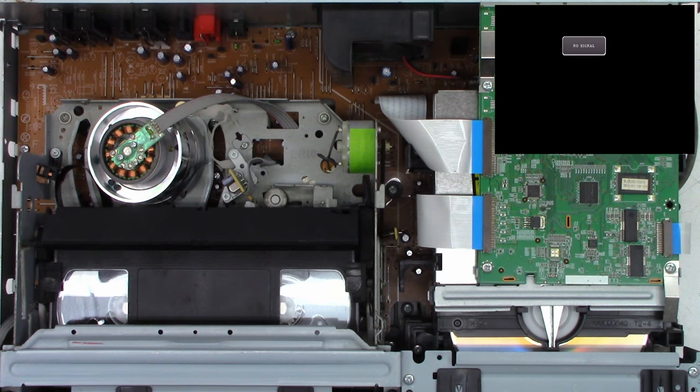And so if you don't know what this does, as this reel turns, you can see there's a hole right there, and it basically blocks the light and then lets the light or the infrared signal shine through. So it makes and breaks the connection optically. The emitter transmits underneath the prism, and the receiver lives under that hole, so it knows basically if it sees the signal and then it blocks it, and it sees it and it blocks it. Written into the microprocessor is a program that basically says after a few seconds of not seeing the pulse go up and down to stop the unit, because it believes that this is not rotating and actually spilling the tape at that point.